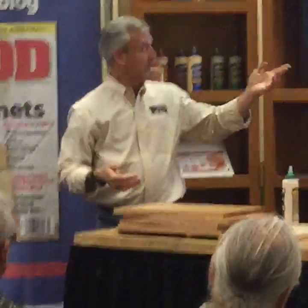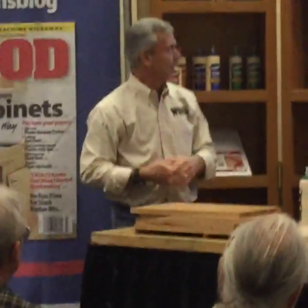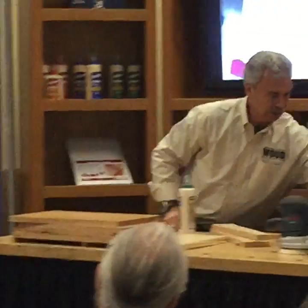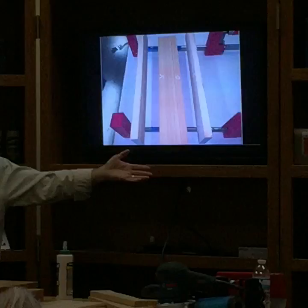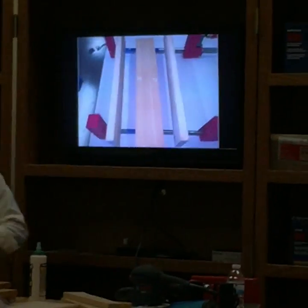Most of you are putting way too much glue on. And the point is, by doing it this way, you greatly eliminate that potential for too much glue. And the nice part is, here it is, and here's what it looks like smushed out. And how much easier this is than doing 5 or 6 boards while you've got them on pipe clamps.